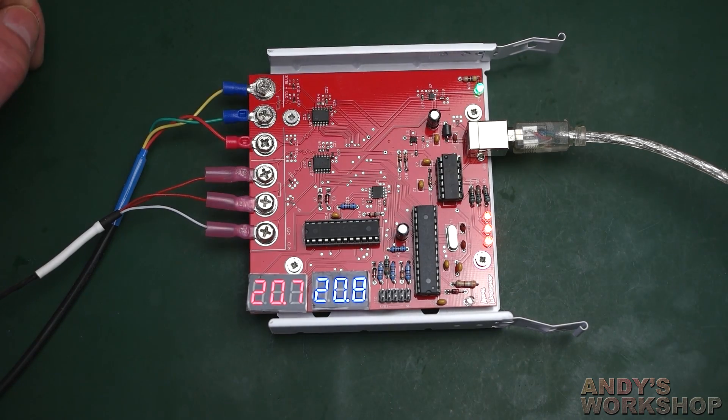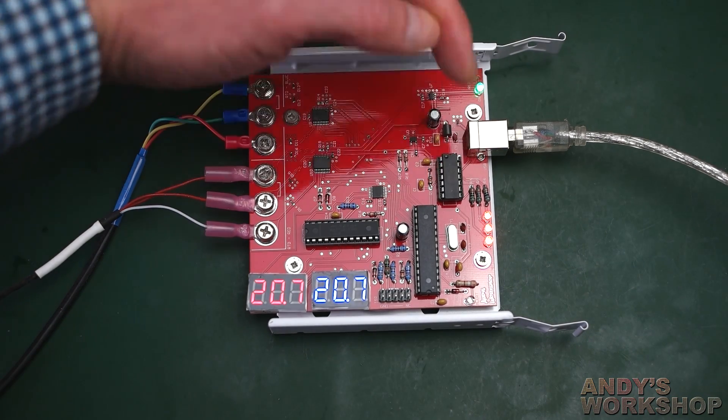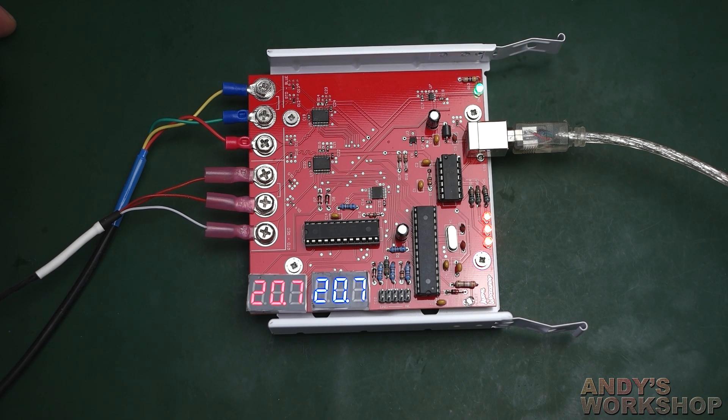Down here is a Microchip MCP2221, which is a DIP USB-to-serial converter — the kind you'd be familiar with from companies like FTDI, but this one comes in a DIP package so I can just stick it in a socket. Rumour has it there's actually a PIC inside in some hardwired form, which is kind of interesting. It's truly plug and play — hook it up according to the datasheet values, no programming needed; when it switches on, it just starts doing USB-to-serial. It's really nice.